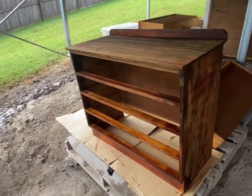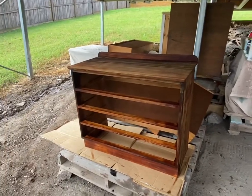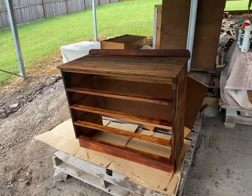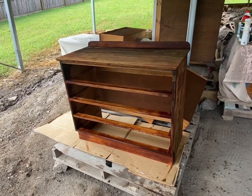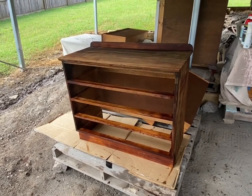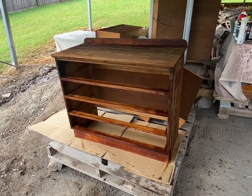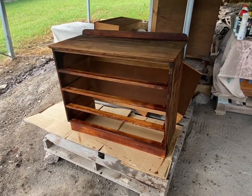And look, I just did it, for those of you who are curious, I've never used the oven cleaner method before, so I just did it to try it, like I'm sure most of you will after this if you haven't already. I did find it a lot easier than paint stripper, and when I get paint stripper on me, it burns like hell, whereas this wasn't too bad. But you still definitely have to take those precautions and wear your face covering, some eye covering, and some gloves as well.